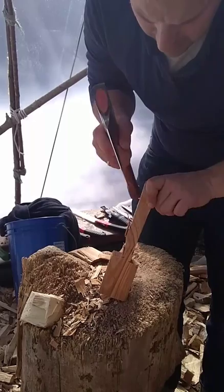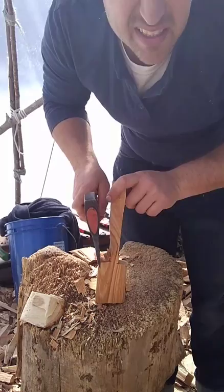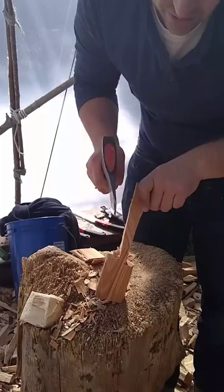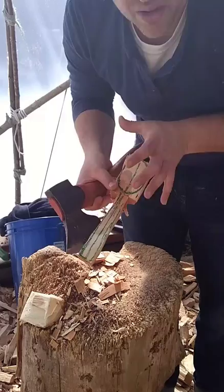So you'll see I'm just twisting just the slightest bit. And I think this is key. When I watch people have trouble and when they almost bash into here with the axe edge, it's because they start off dug in, but then they don't keep it digging in with each bite. They let the axe pivot so that it starts to go down, and then they usually are going too fast and too hard and they end up bashing right here. And even if they pull up in time, if there's a crack there that has created a stress fracture within the wood, as the wood dries out, a crack will open up.